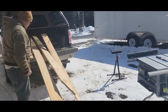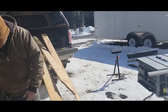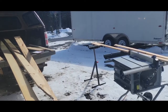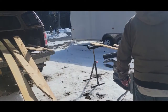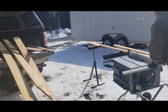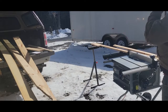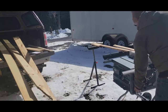The door will probably be open most of the time. So I'll get a circular saw or chop saw so I can cut it down a little bit more manageable. I set the table saw to 2.5, and I want to run up some of these 1x3s I got here. They're a little bit oversized, so I want to trim these off. And then, like I said, I always like to use the smallest lumber.